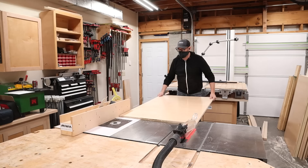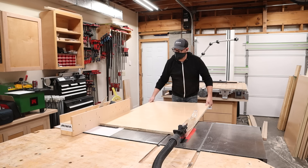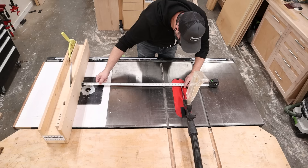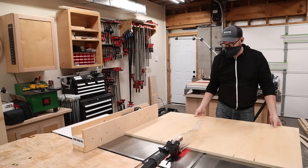While that glue-up is drying, I can move on to cutting the cabinet parts. For the cabinet sides and bottom, I'm using three-quarter inch pre-finished maple ply, the same thing that I build all my other shop cabinets from. I like to rip off the ragged factory edge and make them nice and crispy. Once that's done, I can cut everything to final dimensions.